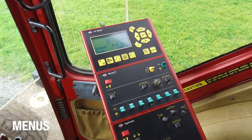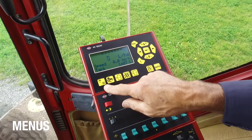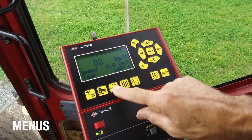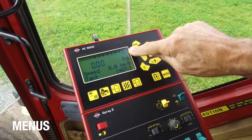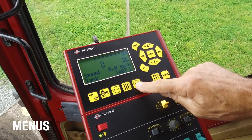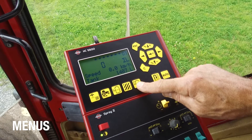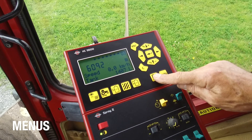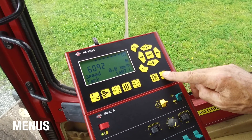Let's look at the HC5500. This line of buttons are presets. This one is the application rate, here we have the velocity and the speed, here we have the tank contents, the area sprayed — and both of these are relevant to register number three — and this one is for the total amount of liquid sprayed out for this register. It could be three or four tank loads shown here. The last button is how many meters or feet you have left before you run out of liquid. The last one is the auto button — I'll come back to that.